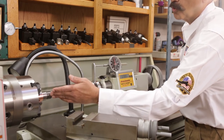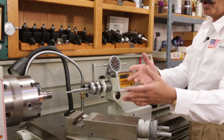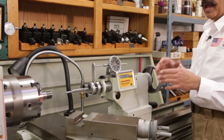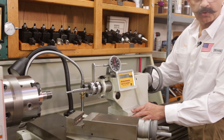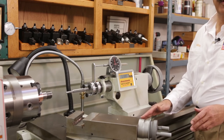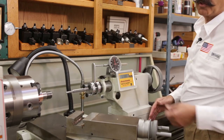You've already set your barrel to zero, set your reamer to the barrel, and you're in the process of chambering — so it's critical to be at the same measurement each time. If you use too much force or too little force, there is a chance that the tailstock will be off by one or two ten-thousandths of an inch, which can affect the chambering process.